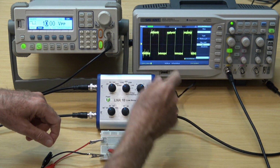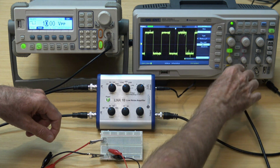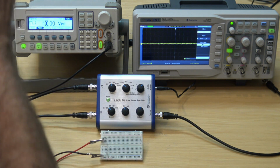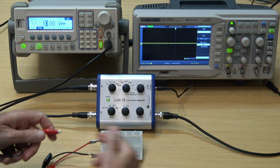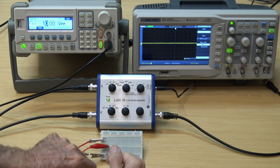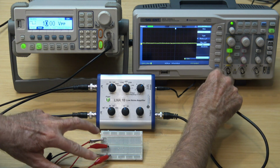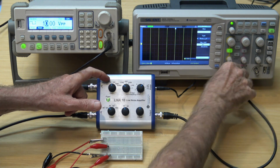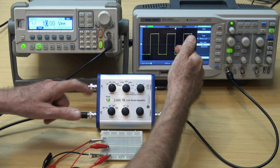There's a significant amount of noise, around half a millivolt, and this is far more noise than what it should be. Now I'll use a differential amplifier to look at the difference in voltage between this point and this point, connecting this point to the positive input and this to the negative input. It will subtract the two from each other, then multiply by a gain of 10, which is the minimum gain of this amplifier, so I'll adjust the oscilloscope to make the trace fit.